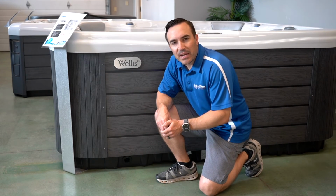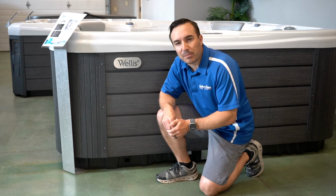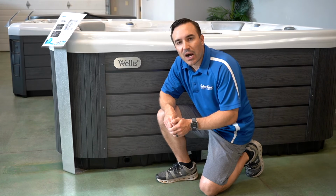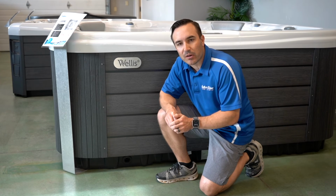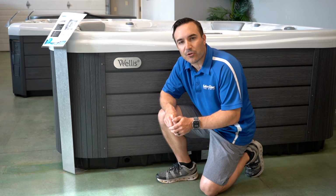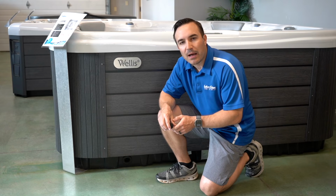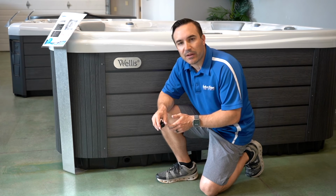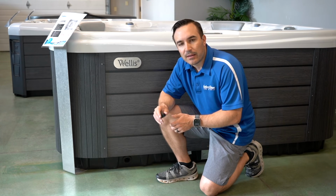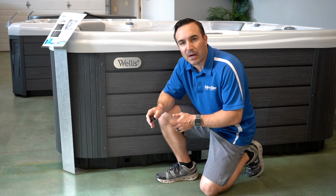All right, the last thing I'm going to hit on is draining your spa. So the first thing to do when draining your spa is turn the breaker off. So make sure that the breaker is in the off position and that the pumps are not operating before you start the draining process. At Southern Leisure, we recommend draining your spa about every 3 to 4 months and refilling with fresh water. This is because the total dissolved solids level increases over time in your spa, making it more difficult to maintain clean and sanitary water.